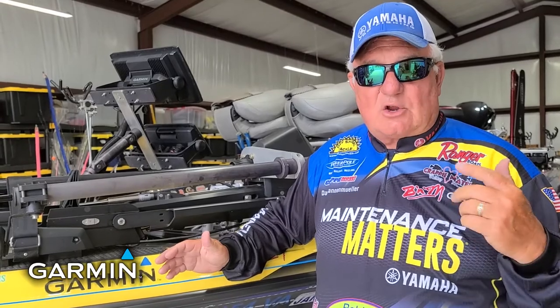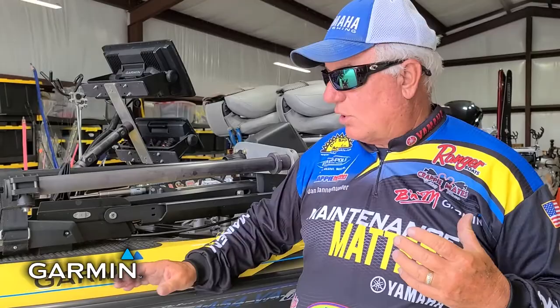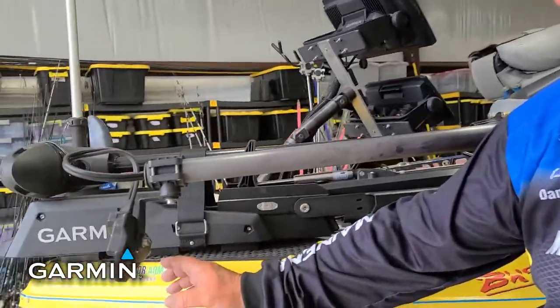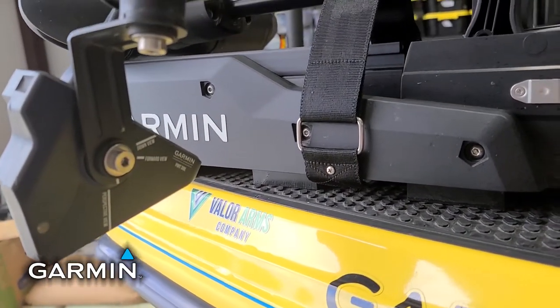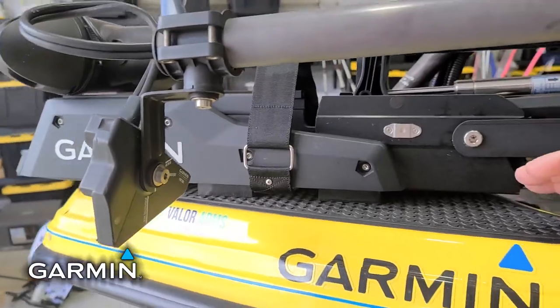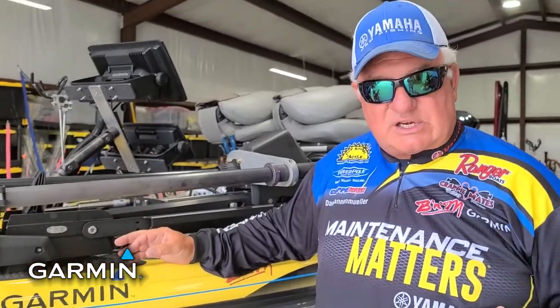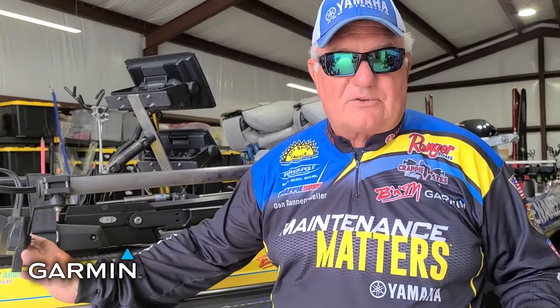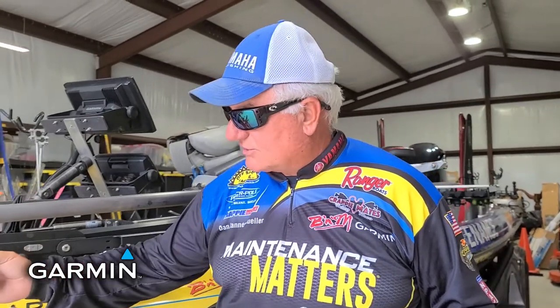You can go up and try it out. See the pictures I put on here. Also know that on the transducer they have now put an overlay that goes on the outside of your transducer when you buy it. You put it on whether you're going to run it port or on the other side of the boat — in this case on the other side of the down pole or your trolling motor. Make sure you know which orientation of the mount you're going to put on there, then put the sticker appropriately on the top of the transducer on the side, as you'll see here.